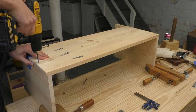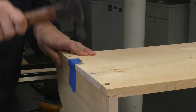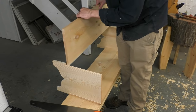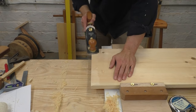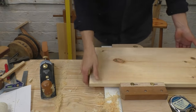Because I took the time to figure out my nails in a test joint, there are no surprises here. I'm starting with the back, so any mess-ups won't be visible, but drilling the pilot holes and driving the nails is smooth sailing. With the back installed, I can flip the whole piece and get the bottom fitted. The stock is both too long and too thick to fit, but that's on purpose. A narrow saw cut fixes the length, and I just use a smoothing plane to bevel the underside until it fits those tight dados. Cutting the bottom to fit the joint is a foolproof way to get a perfect part — unless, like me, you cut the bottom too short. Twice.